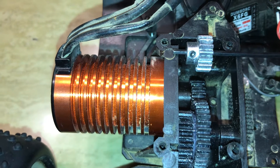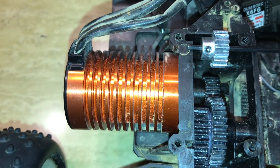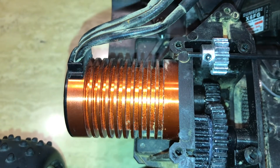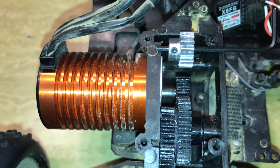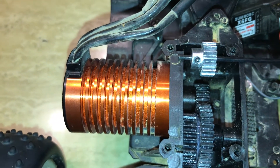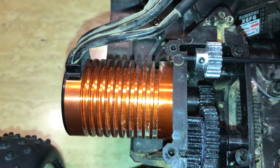I'm not 100% sure the math works like that, but it seems to, in that the original A and D holes seem to work with the 18-tooth pinion. So some of those extra modifications I had to do to fit the 17-tooth in there, it doesn't look like you need to do that with the 18-tooth, so it'll be a lot simpler actually.